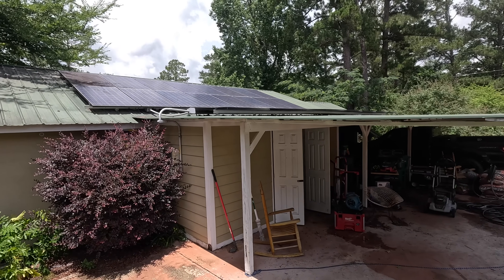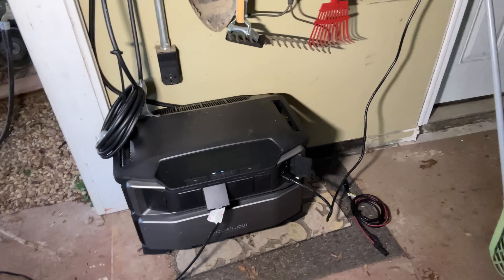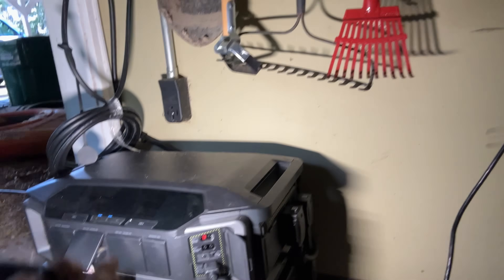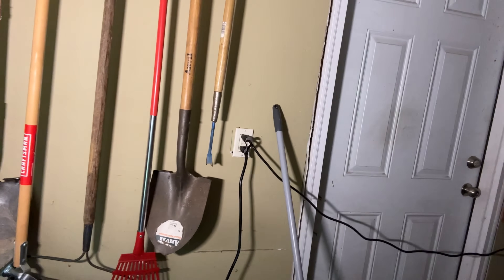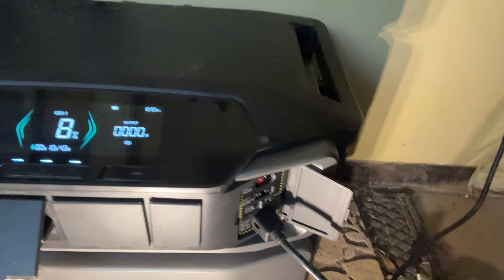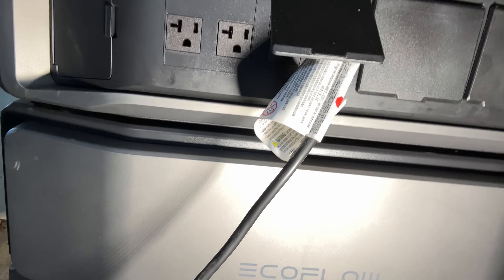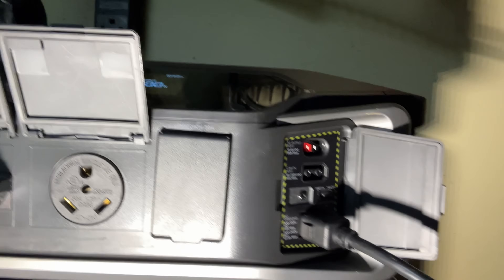Because I have solar panels, and this has an app that goes with it, I don't have to actually charge it with the solar panels directly — it can do all of that. But I can program it to only charge during the day and then just plug it into my wall, so it's getting augmented power to charge. When the sun goes down it stops charging, so the solar is helping to charge it. I have 20-amp outlets here — right now I'm only using it for the battery charger. This is a 30-amp 120-volt outlet.